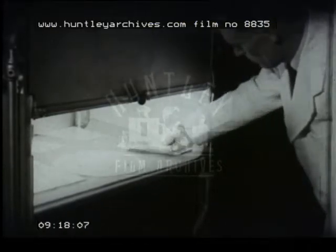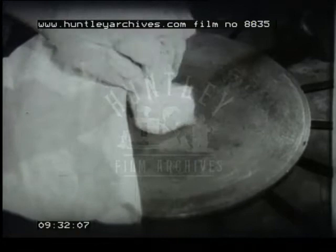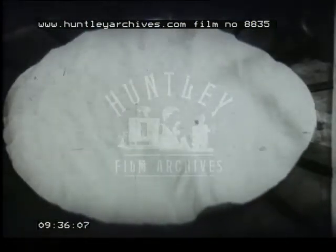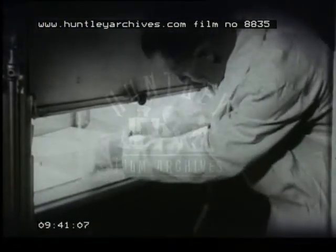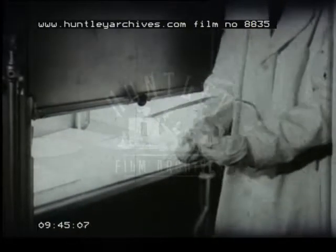For thermoplastic sheets to be shaped, they have to be softened by heating. This can be done in an infrared oven. The sheet becomes quite pliable and can then be shaped in several different ways. One of the simplest ways is free blowing. This is a steel blowing table connected to an air supply line. It's covered with a diffusing cloth to insulate the sheet and to prevent cold air impinging on the centre of the shaping. After heating, the material — clear acrylic sheet in this case — is ready for blowing.